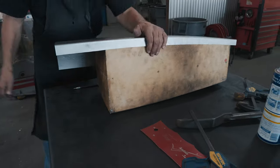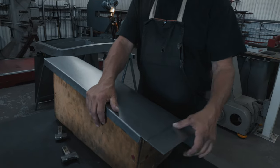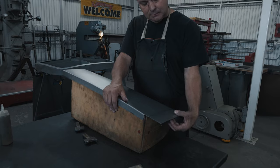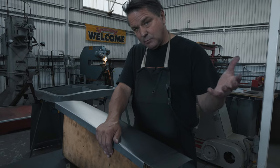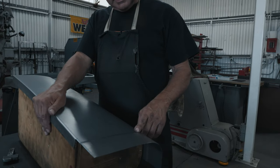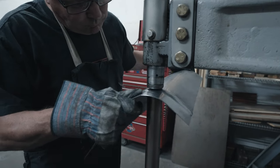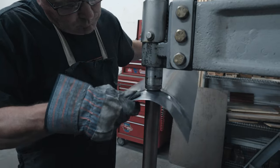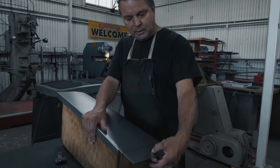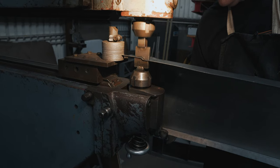So we've got our panel shaped. I turned this flange to fit on the buck. I did a preliminary start of the bead. I'm doing this one a little different — I'm going to put half the bead in and then turn the flange this time. I'm just showing a different approach to do the same thing as what we did using the other equipment. Got to do a little pre-stretch down here in the corner because it's starting to suck down in here. I'm going to go in with a planishing hammer and stretch this corner, run it through the pull max after that, and we'll have our bead put in here. Then we'll mark it, trim it, turn the edge, and we'll have this bottom bead area.